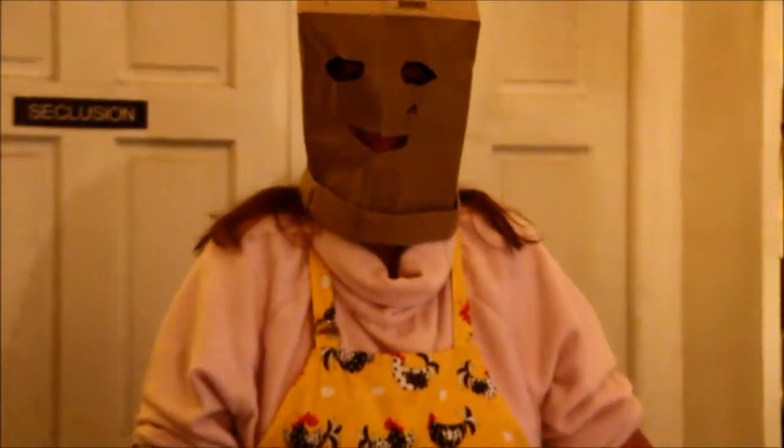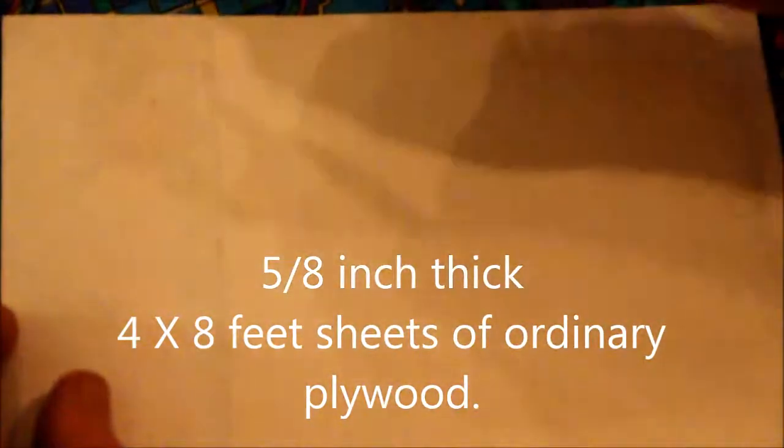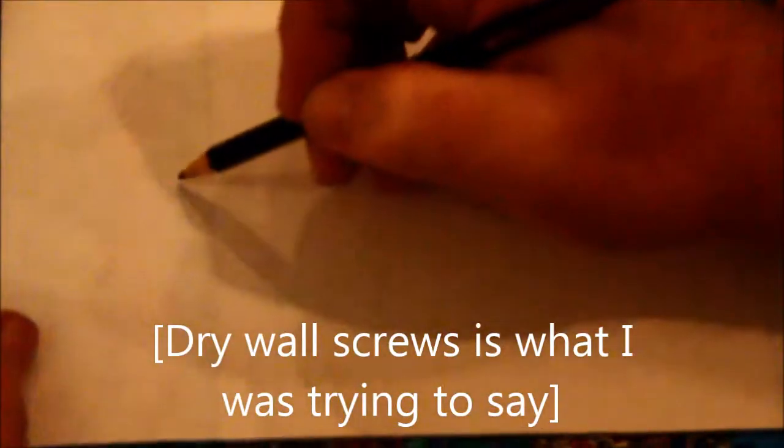Just to rehash what we talked about: we took three sheets of 4x8 plywood put together with sheetrock or wallboard screws, about two inches. One sheet for the base, then we added six casters. We allowed for the caster height to reach whatever working height we wanted — 30, 32, or 34 inches — and that gave us the top plate of plywood.